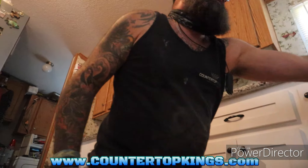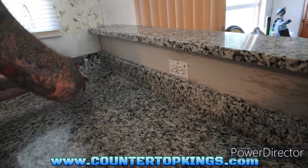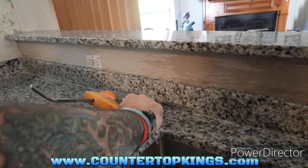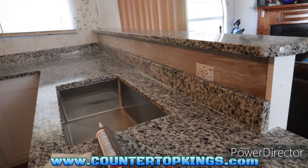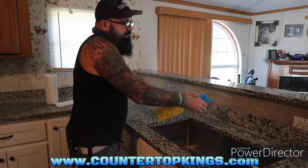It shouldn't be like that — you should be able to set the drawer in there, slide it out, those pop in and that's it. If I'm paying top dollar for new cabinets with sliding drawers, I want them to easily snap in and snap out in case I need to pull a drawer out. Tawny has caulked out most of everything. All we're going to do is finish with a transparent white silicone because it matches the color of granite we've got. I always spray it with alcohol — if you spray your silicone with alcohol, it will not go anywhere except where you want it, so you can have a nice clean bead.